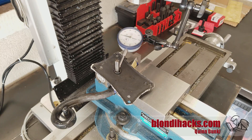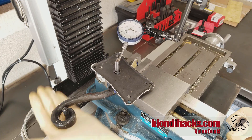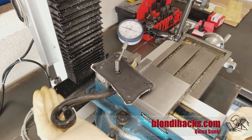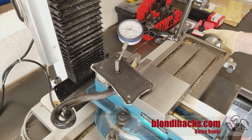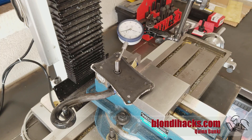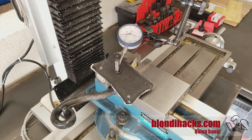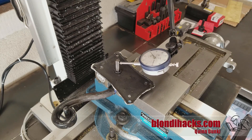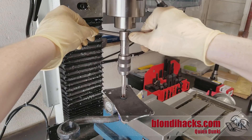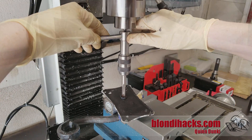To start with we need to re-thread the handle. I'm using the original shaft to square up the hole relative to the mill so that I can make sure to recut those threads nice and straight. I'm just using an indicator here and tapping that in until it's nice and straight. While the threads were pretty badly damaged on the original, they were serviceable enough for this operation. Then I use the edge finder to center up, remove the shaft, and go ahead and re-tap those threads.